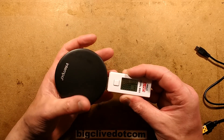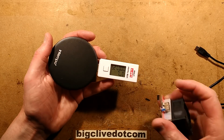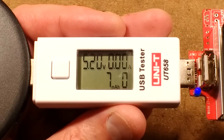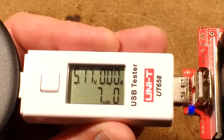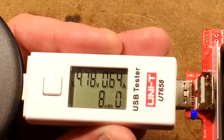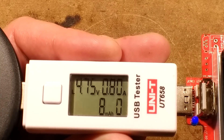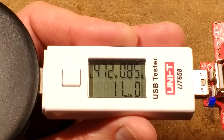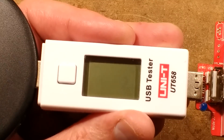I've already tried this with various loads and it's got the annoying quirk that if you plug in a very light load like Christmas lights, it will power them for so long and then sort of go into a sleep mode and just test the output. Here we go — 5.2 volts. So let's start pumping the current up. The voltage has dropped off straight away. One of my pet hates about LCD displays is they take the text right up to the very edge where the shadow of the bezel hides it. It's actually 4.720. Oh, it just cut off — let's start that again.